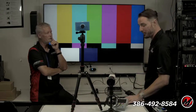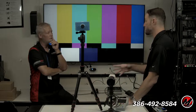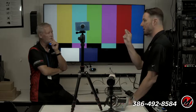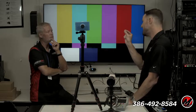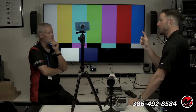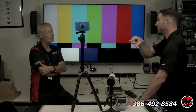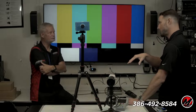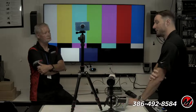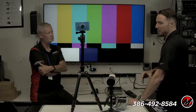But we have a lot of projectors now, and most of them are going to be laser-based. Most of the time, the lasers are about 4 nanometers, maybe a little bit less. I can't really trust a meter that's reading 10 nanometers wide if I'm trying to read something that's 4. But if I use something that's reading at 2, I know 4 is easy. So that was really the main reason. If there hadn't been all this laser-based stuff in the past 2 years, I'd probably still be using my i1Pro 2. It's a great meter for the money.